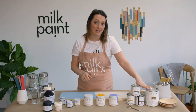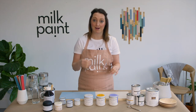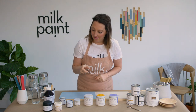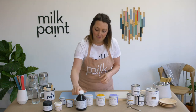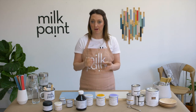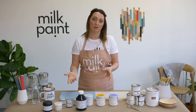The gel stain is really good for hard-wearing, durable areas. Say someone does their flooring in milk paint and wants to add a top coat — they can, which is super awesome. With hemp oil, this is a really fabulous finish and one of my absolute favorites. If anyone is walking into your store and it's their first time using milk paint, I would sell them hemp oil to go along with it because it's the easiest top coat to use.